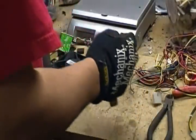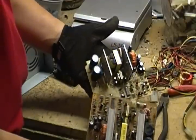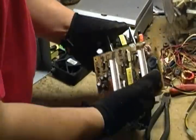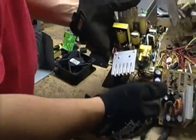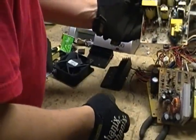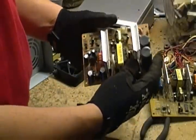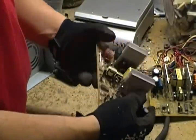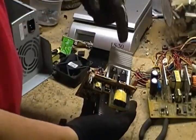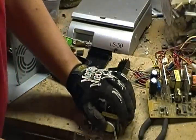I've got one around here that's already done. You can see different sized heat sinks — basically the same as what they look like. This one has two transformers, this one has three, and a lot of them I've seen lately have four. That's the next thing I would do: take off the aluminum heat sinks and then the transformers. On one like this, where the screws for the heat sinks are in the middle, you can just try to bend and break the circuit board itself so you can get access to the screws — whatever is easiest for you. It's all scrap, so it doesn't matter if you break it.